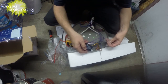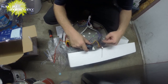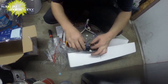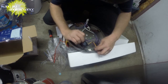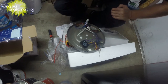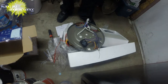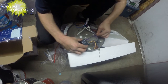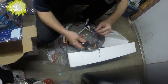Now, we've got a blue switch tab, a yellow switch tab, and my thought is that all of them should feed out to there, any one of them. So the fact that we only have continuity along the yellow or along the purple when that's switched is awfully suspect to me. It makes me suspect this capacitor.